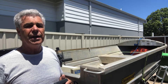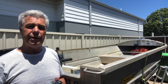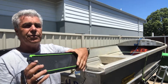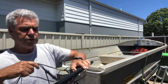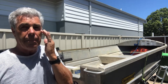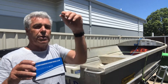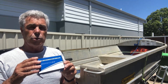But now that I'm going to electric start, I need something with some cold cranking amps — enough to turn that motor over and also run my sounder. So at this point in time, I've just been using a tiny little panel like this and putting it on the tabs of that battery. I can charge that up very slowly because there's not much power coming out of this, but that's been enough just to top it up. But this time I'm going to go for a slightly bigger solar panel fixed to the boat, and I'm also going to have a solar charge controller as part of that system.